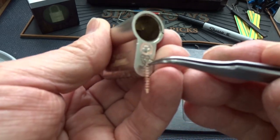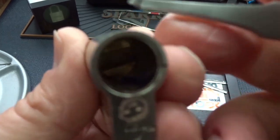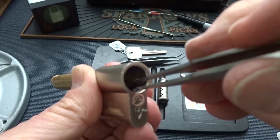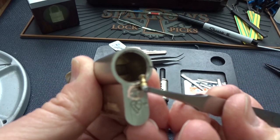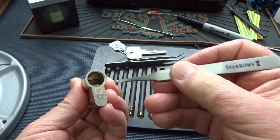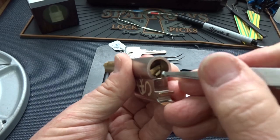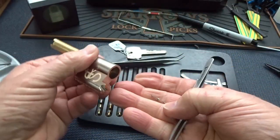Very light spring. Alright, number four — again, he just barely breaks the shear line. Let me get a light down inside of there so you guys can see what I'm talking about. Oh wait — I forgot to pull the shim out. I didn't see him — he was perfectly flush with the side there. There we go, now we are in business. Look at that — very deep spool. And different springs — we got four different springs so far, five if you count the inner one. Let's flip it over. Okay, we have an Assa pin — I believe that is a commercial one. Finally a duplicate spring.